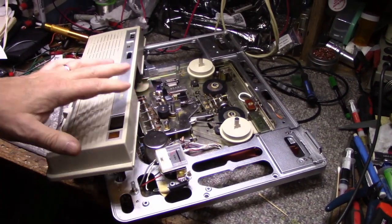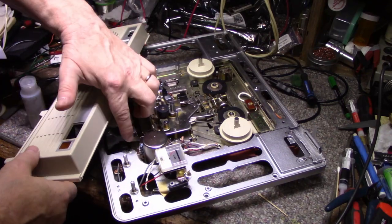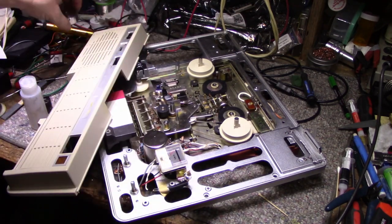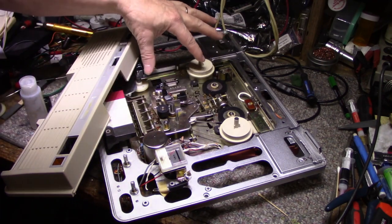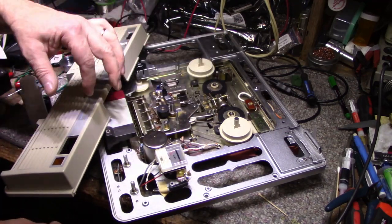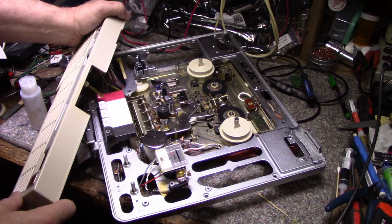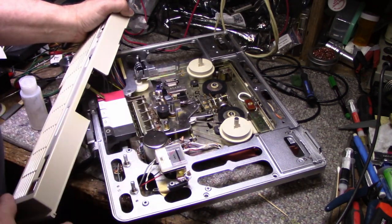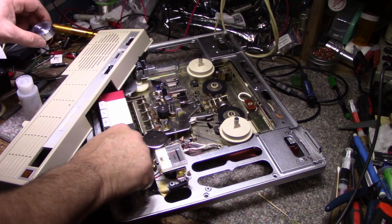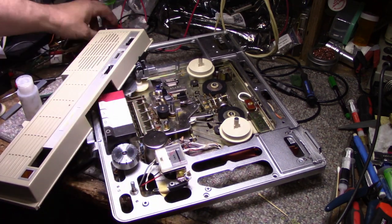Okay, I'm now ready to assemble. Got to make sure, go through all the wiring, make sure everything's correct. I remember I got to fix this here. I wired in the motor backwards, so I'll do that before I wrap this up. I was just cleaning the knobs, put those back on. I'll clean the pots too. Everything mechanical here is done, except this motor hasn't been oiled yet. I can do that from below, but I think everything here is done except for the two knobs to put back on. Now inspect your wiring, because a lot of these wires will break off from moving this around and flexing, and sometimes it gets pulled on. Check your work over, make sure there's no broken wires before you stitch it all up.